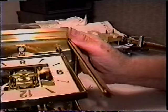And I'll get to those two mounting nuts there that are holding the clock frame in. I'll go underneath here and I'll take one out here. There's two. There's one on this side and one on the other side. I'll turn it around. And we'll get the other two. It's pretty well balanced. If you don't get it out too far, you shouldn't have any trouble losing it. And we'll take the other one out. Now you notice, even the screws underneath are highly polished. That's the quality of the clock.